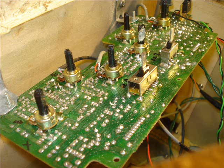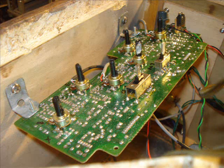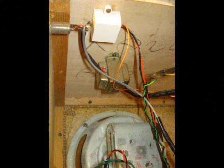I use tape. In any event, I discovered in this project I had a lot of room to work because the chassis was so big I could just leave them in. And my realization was that you don't have to remove the pot. You can leave them in there. You just turn them all the way down, cut the new one in, or that would be turn them all the way up, I would guess you would say. So there's no resistance, and then it doesn't matter if you leave them in. And phooey on me for not realizing that ages ago. But you don't always think of everything.